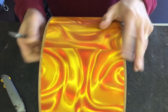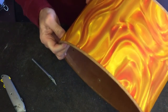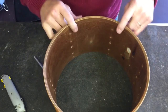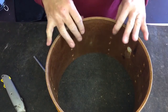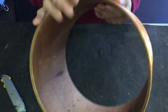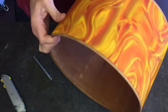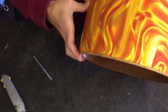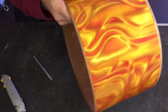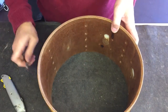The seam looks good — you can burnish that down a little bit to make sure it seats real good. Don't put the seam under your lugs where the lugs actually are, because when you tighten the lugs it'll cause it to buckle. Put it in the center between two lugs or two rows of lugs so it has a nice flat surface — it's not going to buckle or bow. Burnish it down real good, rub it down to make sure it's stuck down.